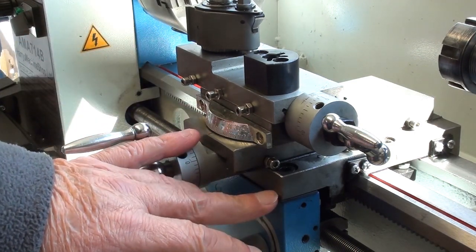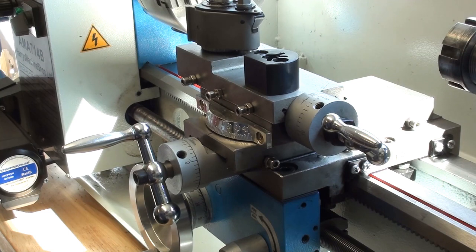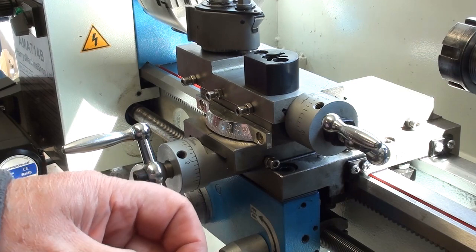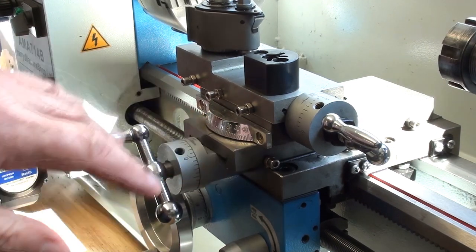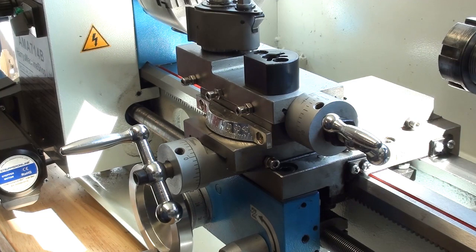The shims I made up are 3D printed out of PLA with carbon fibre. I printed up two or three different thicknesses — I think the two I've selected are 0.8mm and 0.6mm — and that seems to be working. How long they'll last I don't know, but for the moment they seem to be standing up quite well. Quite pleased to have got that problem solved.